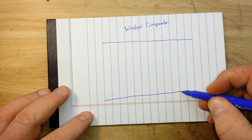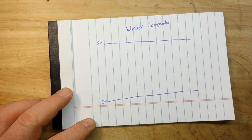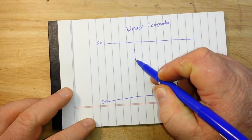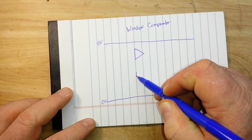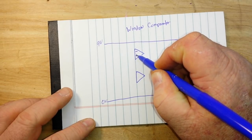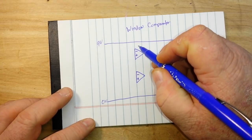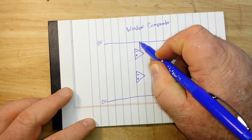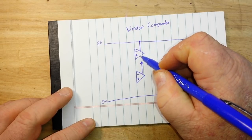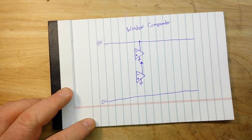So, let's start with our two rails. We'll say 9 volt and we'll call our ground, ground. So, the first thing we need are two op amps. I did a video, maybe a month ago on comparators. And yes, I know there are standard comparators — we don't need to use op amps, but I don't have all that stuff at home, so we're just using what I have here. Here are our two op amps, both going up to 9 volts, and they also both are going to ground. That is the power setting for our op amps.